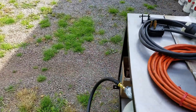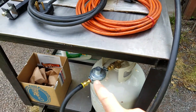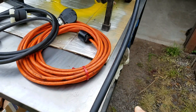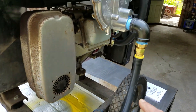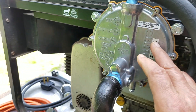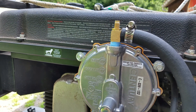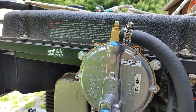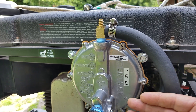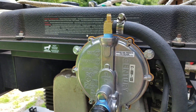From the propane tank up, they include a high pressure to low pressure propane regulator. The hose and all the couplings come up through this coupling and go into this control unit, which is basically a propane regulator. When there's no demand — no suction on the suction side of the engine — the propane regulator is closed so that it won't leak propane out.